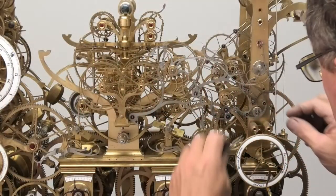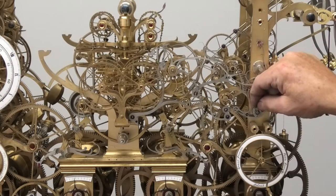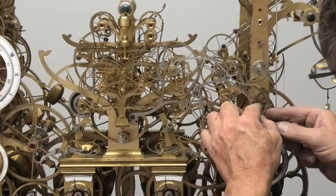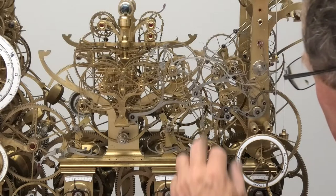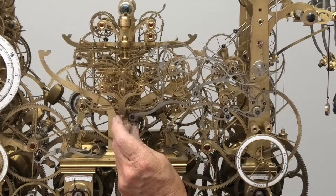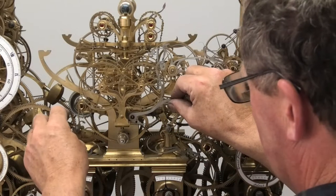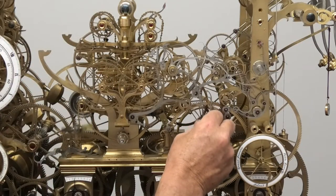And the quarters feed pull assembly is removed. Now we have in the way the strike rack. The strike rack is held in place with a little keeper plate. The keeper plate is loosened and rotated outwards. This allows us to remove the strike rack drop fly.